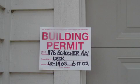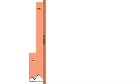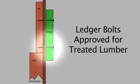One first step might be to check and see if it was built with a permit. Let's say this is your house wall, and the green board here is where your ledger is going to go — or maybe it already is on. Check how it's attached. If it's just nails, it's pretty likely it's going to fall. It should be bolted. Two bolts every 16 inches is pretty standard.